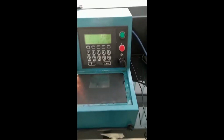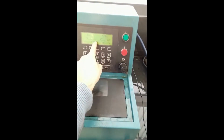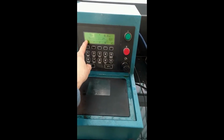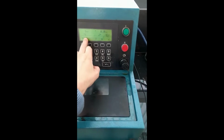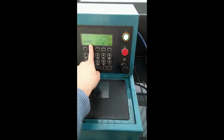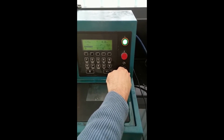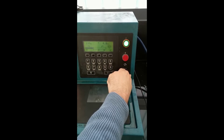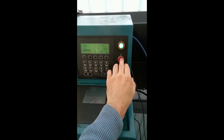Right, this part of the video, I'm afraid the sound was too bad to use. So Albie's doing a dribble test. I want to see that the injector opens. He's going to see if it doesn't lose enough pressure to go below 100. It's basically that the fuel's not dribbling out. He's turning the frequency down to get it a bit slower. And that injector is pretty much spot on. He's going to do the rest of the injectors and let me know how he gets on.